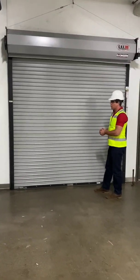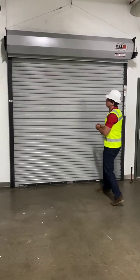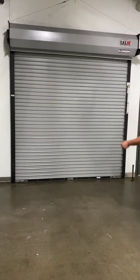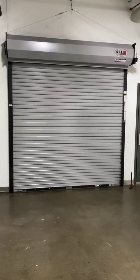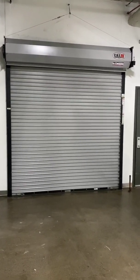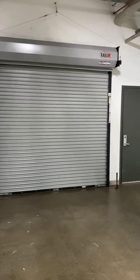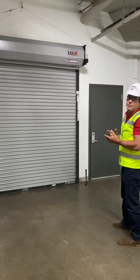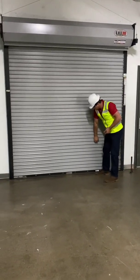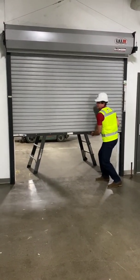These technicians are doing a much more thorough inspection. I'm just giving it a brief overview for video purposes. Another thing I want to point out — this one is really clean and easy. We've got a nice hood up here. No dents in that. If there were dents, that could cause the door not to travel back and you would have to fail it. Any holes in that hood would be an automatic fail because they could allow fire to come through. This door seems to balance pretty well, and my technicians have checked to show that it passes the inspection.